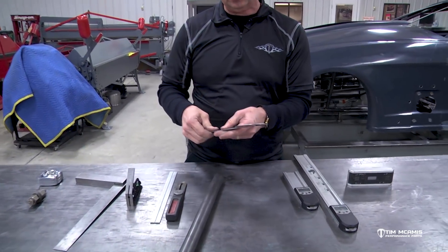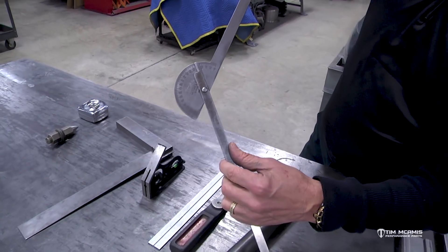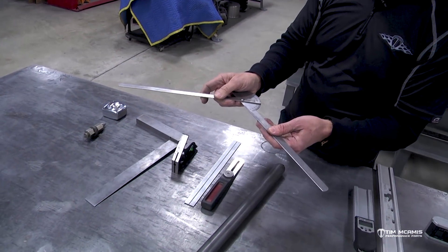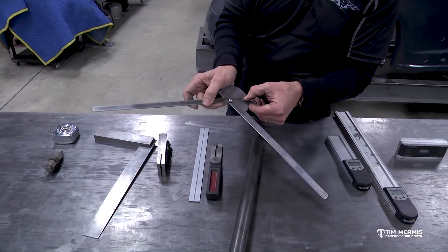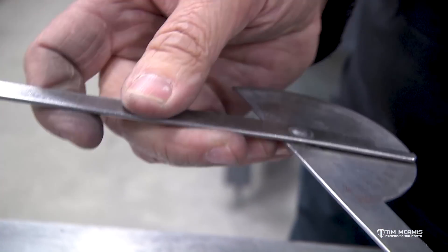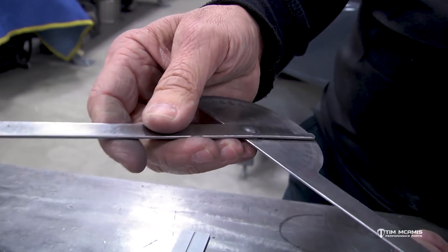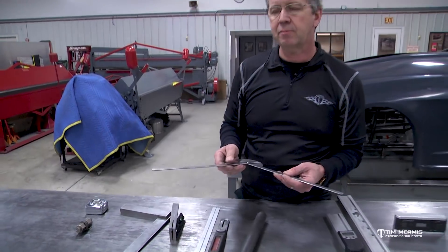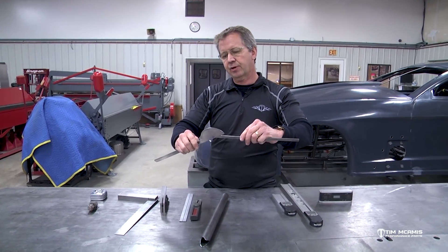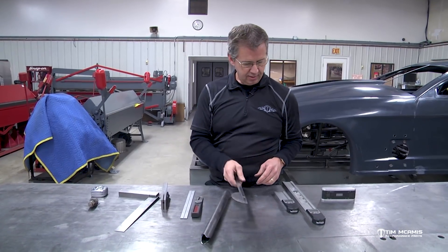Getting into more measuring and degrees: this is a really nice little stainless steel degree protractor. You can see it's got degrees marked from 0 to 180. It's really nice for checking and duplicating bends — it's got a line cut that shows a straightedge so you can roll it around on two different tube angles. If you get 70 degrees, you can transfer it to the other side and see if it's 70 or 71. Great for checking tubes that are bent — the main hoop, door roof pipe, strut bars. They're cheap to buy.